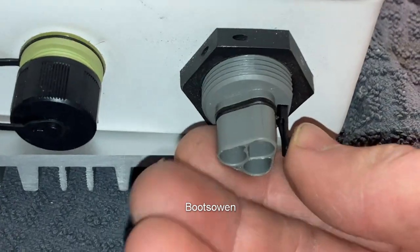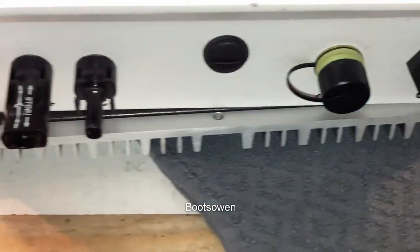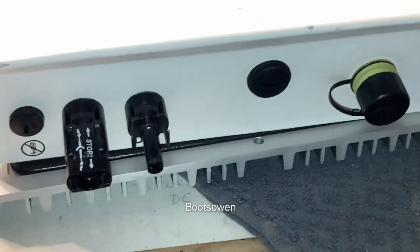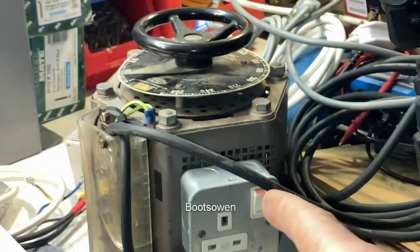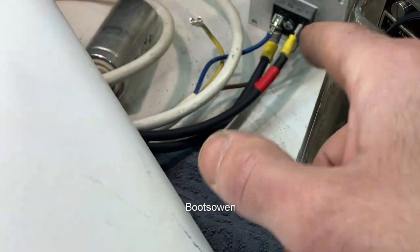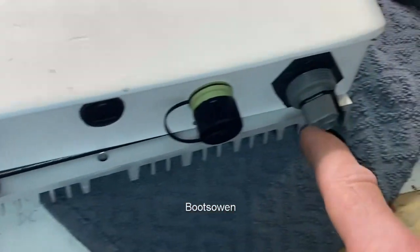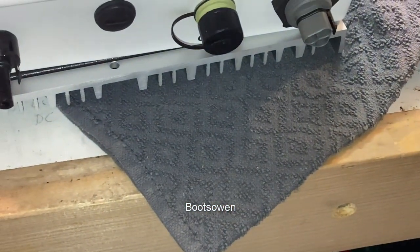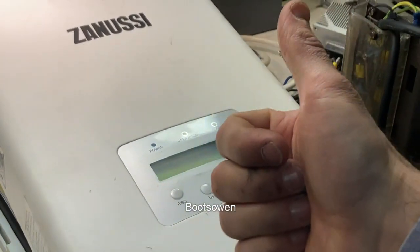It has this type of plug, which I need a version of to test. But for the moment I've been just taking the cover off and putting spade connectors onto the inside, or screwing them in, depending on how you do it. But I'm quite pleased with that — that's going to be used somewhere. It's a very simple test setup. I've got a Variac plugged in here, then this has an isolation transformer in it to break the link with the mains. That goes into the rectifier and it has a bleed resistor and capacitor on it. Then the DC comes in here and the AC plugs directly into the mains as it would if the thing was installed. Obviously it hasn't got the disconnect switches and all that because it's just on a test bench arrangement. Any questions or comments, please leave them below. You don't often see an OC1 — I've never seen one before. Thanks for watching. See you later.